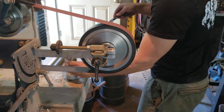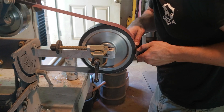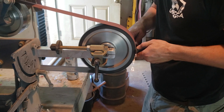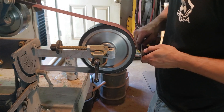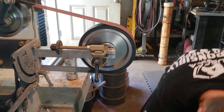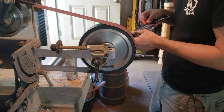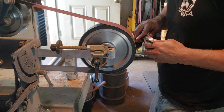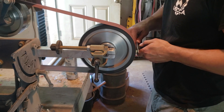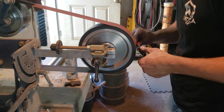I'm coming in, being gentle. I've turned the speed on my grinder down a little bit — the finer the belt, the lower the speed you run at; that helps keep the temperature down. I'm just tweaking little areas and doing little bits of cleanup, then into the water. You don't have to have some crazy professional quench setup — that is literally a can of organic energy drink I had that morning that I just cut the lid off of. Use what you got and you can make it work.